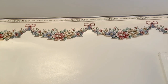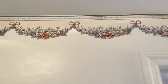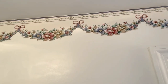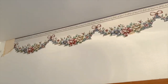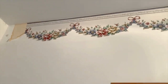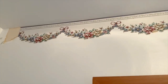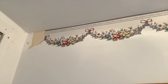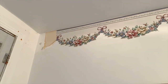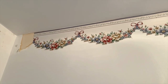I'm in the bathroom upstairs and I'm going to take down this old wallpaper border that we put up a while ago. It's starting to peel and we want to repaint — we don't want to use this banner anymore. So what I did was make up a concoction of vinegar and soap in a spray bottle. Without wrecking the wall, I'm gently peeling off the paper and then gently re-soaking that area and scraping it off. It's going to take a little time and we don't want to ruin the sheetrock, which — if you know anything about taking wallpaper off a wall — is a tough job.